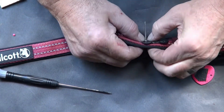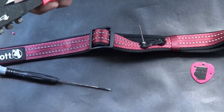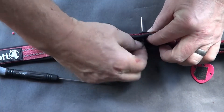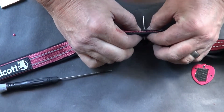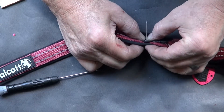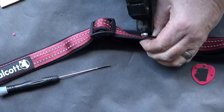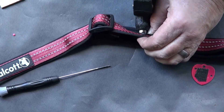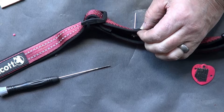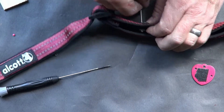I can squeeze it and get a washer to go. What I'm going to do is just tack this one — what I mean by that is I'm not going to fully pull the rivet and click it, I just want to get it started so it won't come back out. I'll get the washer as tight in there as I can. I have longer rivets if I need them. The rivet has started to swell, so it's going to keep the washer and everything in place.